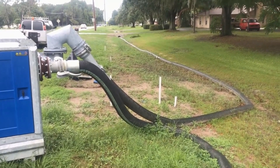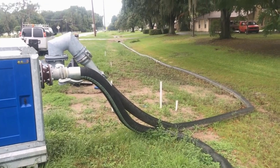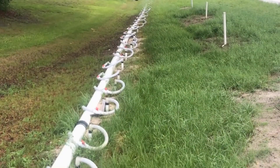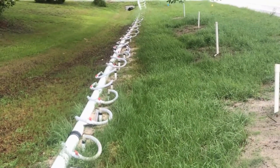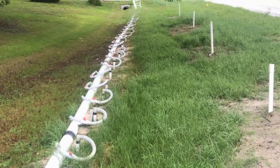I've posted this little clip before, but I really want you to see what Apple Drains deals with when we talk about groundwater and how well our French drains work. They have to work 110% because of the groundwater. On a deep excavation, a dewatering system is needed — there's no way to dig down more than a few feet before you'll hit water.